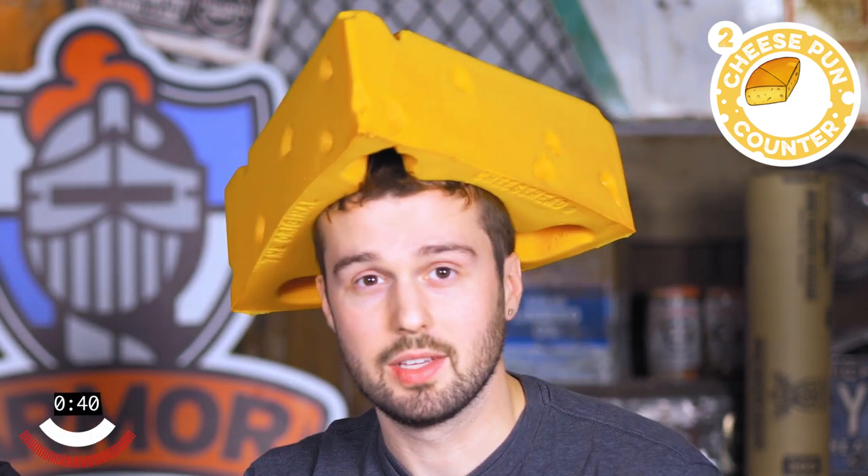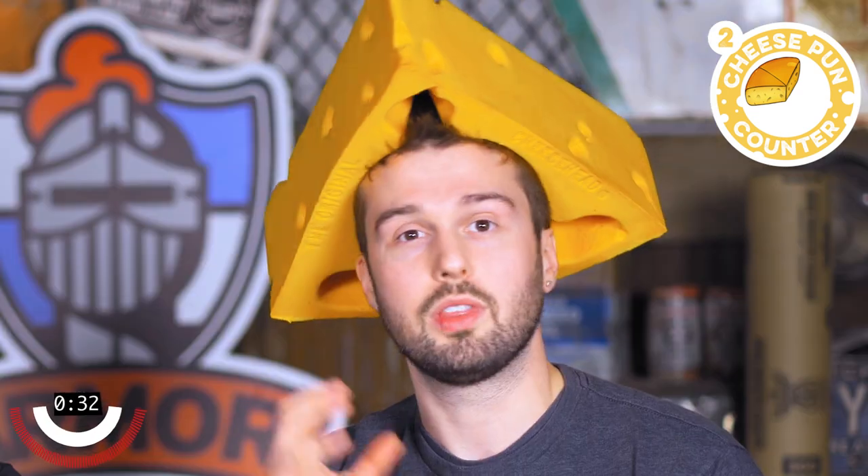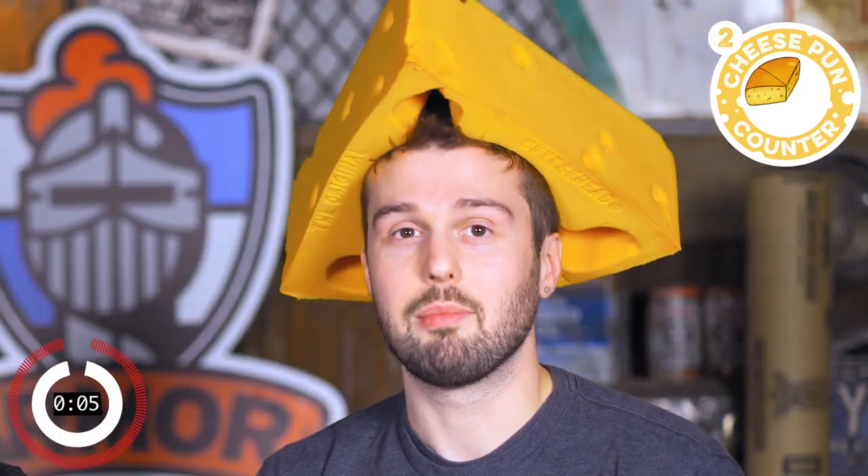Now why are we even talking about this? It's because there are certain manufacturers out there who take a micrometer to a poly VCI bag and associate the thickness of the bag with the quality of the bag in terms of protecting their metal part against rust. That is a misconception, and we'll bring it back to the cheese to show you why. Hypothetically, let's say all of these cheeses have the same thickness of packaging material — well, they're all different. We have soft cheeses, hard cheeses, dry cheeses, and wet cheeses. Just because this wax is the same thickness as this mozzarella covering doesn't mean it's the right application for that product — just like how a generic VCI poly mono film is not the best application for your metal part.